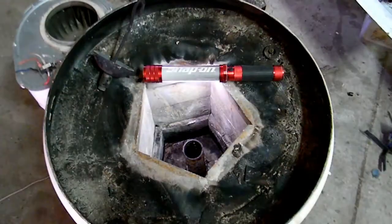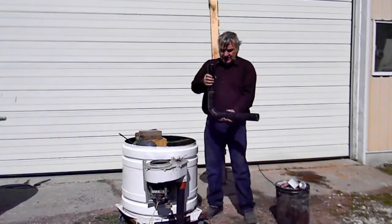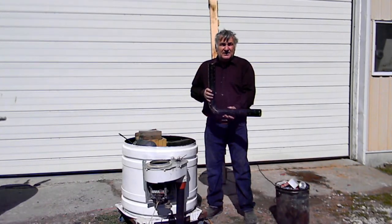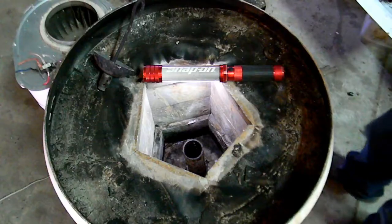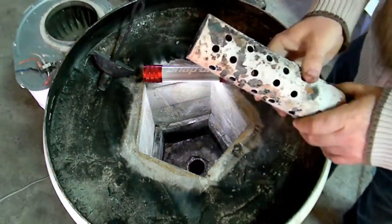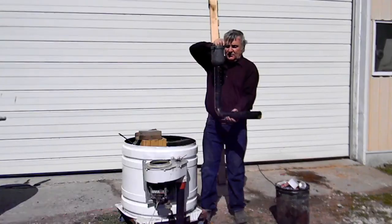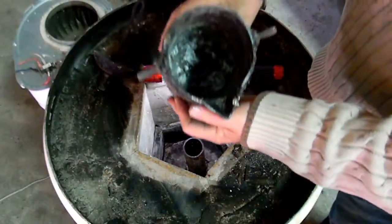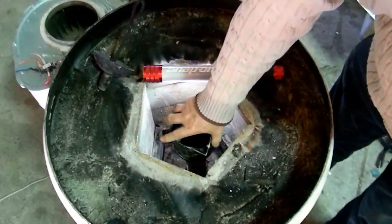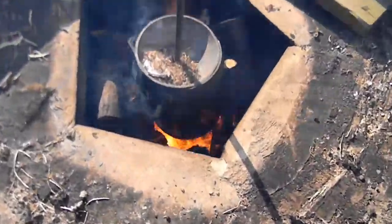The inside mechanism is really simple. You have a tube with a 45° bend in it — I got this one at the scrapyard already bent, but you can use two-inch plumbing fittings. This piece is where your air comes out. On top of the whole assembly is your grate, and the wood piles up in between all the way around. All that air blowing in blows it to a super bright orange flame, and it'll turn that scrap aluminum red in no time at all — a nice feature just using wood.